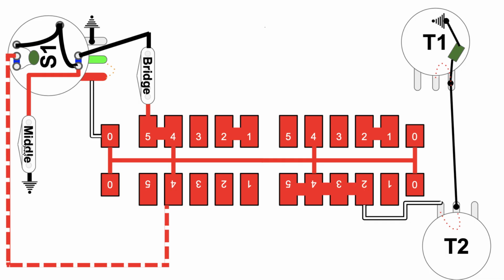Great. And again, here we see that we are bleeding some of that audio off this direction and changing the tone a little bit by pushing it through this capacitor and again coming back and contributing that bit of audio to the backbone. Coming back over here, same as before, it's just tone pot 2 in play.